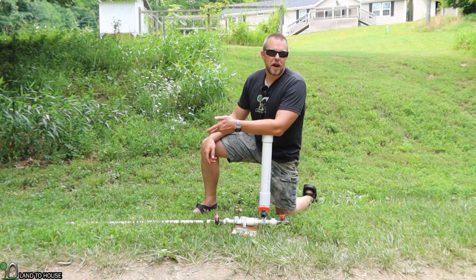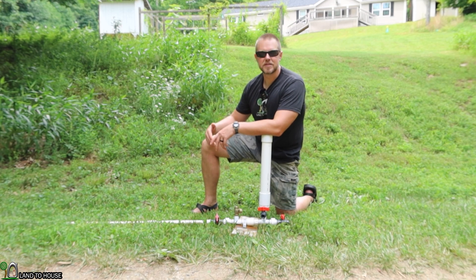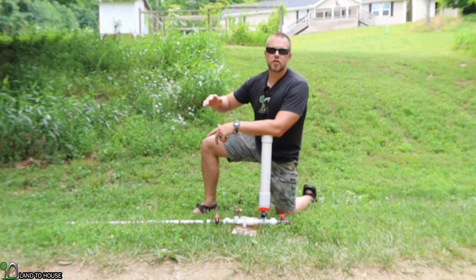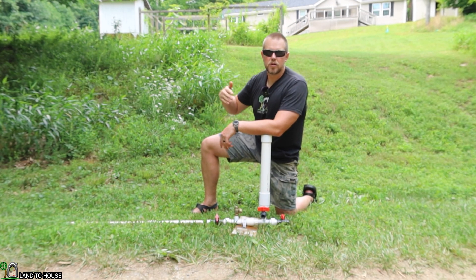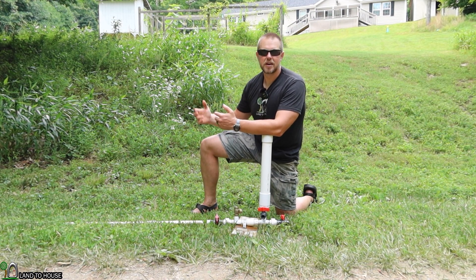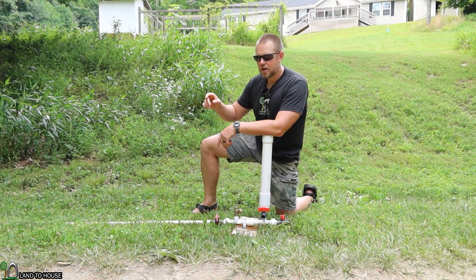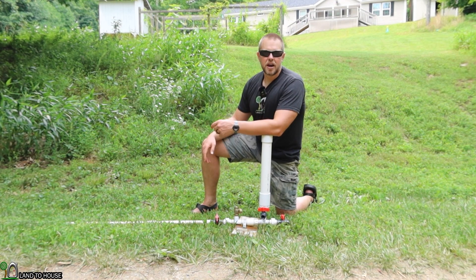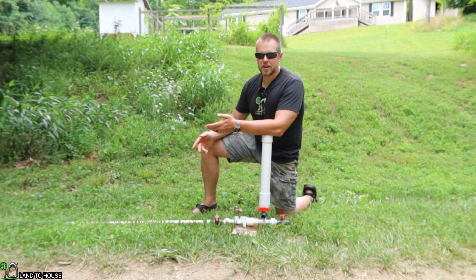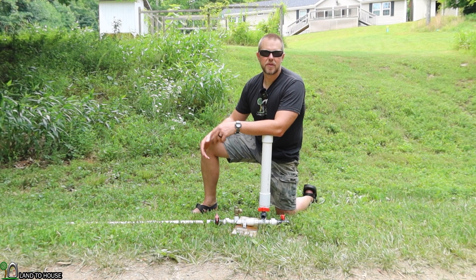I hope this video helped you understand the two main reasons to install a standpipe for your ram pump system. To recap: if you have a drive pipe longer than 100 feet, put the standpipe in at about the 100-foot mark, and you can carry on your supply line as far as you need — the ram pump will use that standpipe as the new source closer to the pump. The other reason is if you already own bigger pipe and don't want to buy new pipe, you can use a larger supply line and reduce down at a standpipe to match your pump drive pipe size. If you have less than 100 feet of drive pipe, adding a standpipe is not worth doing — it will actually increase cycle time to faster than once per second and make the system less efficient. So keep that in mind. Thank you so much for watching.